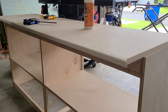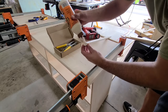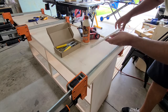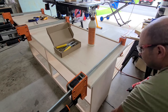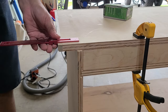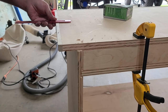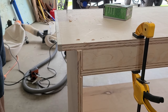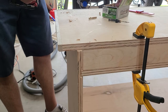I'm doing the same thing to the sides — I cut out 45-degree angles to give it a nice look so you don't see an edge when looking at it, and I shoot them in and clamp them up. This is upside down — I'm countersinking some holes into the bottom after lining this bottom piece up to the box, and I'm running screws into the sides, front, and back of the cabinet box to hold it securely.